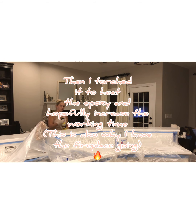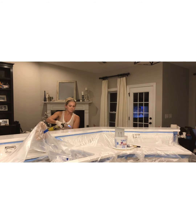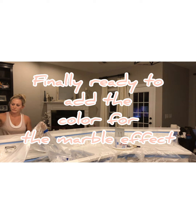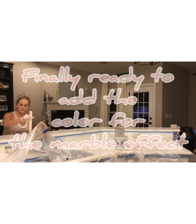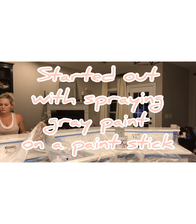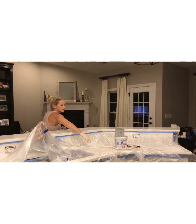I've edited this video to make it as short as possible — we're at about 20 minutes now, but the original video from start to finish was an hour, so that's how long just this one piece of countertop took me. You can see I'm torching the countertop here before I've even applied any color, because I was afraid it was going to become too tacky — torching it gives it a little bit more working time. For the first step in creating the marble veining, I used a paint stick with some spray paint at the end of it, a technique used at Stone Coat Countertops that works very well and is quite easy.